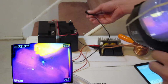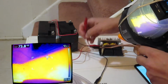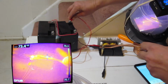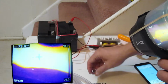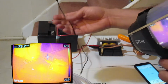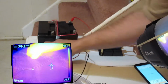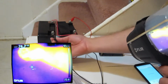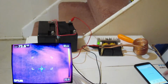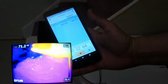Okay, so let's get our cables hooked up here, and of course, we'll do the positive one over here. We'll do positive on that side of the battery, and these things untangle a little bit. I have a jumper wire going between the 2 batteries so that puts them in series, and we'll turn this on and we'll start our timer here. Okay, so the timer is going.